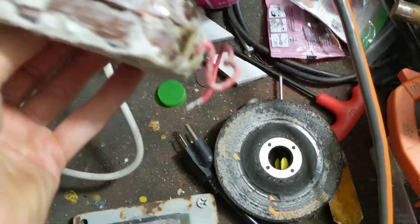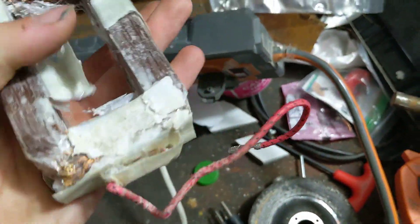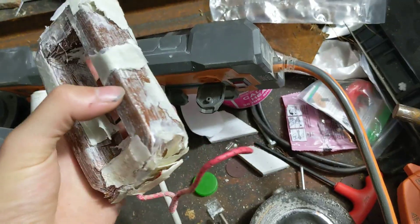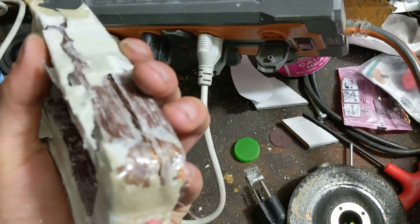Obviously, the high voltage winding — here it is, it's on the grinding disk — is only rated for half an amp. This thing puts out 2000 to 3000 volts at half an amp, a third of an amp. So five amps will just fry this thing up fast.